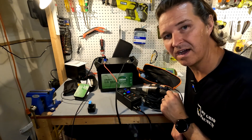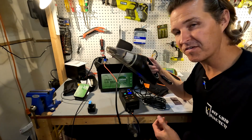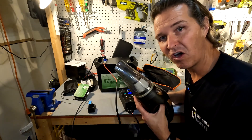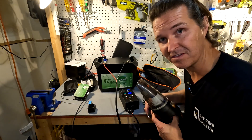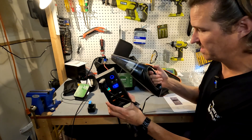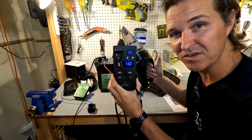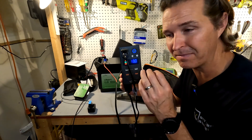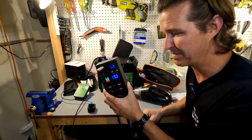To test a portion of the DC controller box, I'm going to plug in this car vacuum — it's called 'This Works.' I use it when camping to vacuum out the inside of my tent, and this thing is an energy hog. Only a couple of portable power stations will actually run it because it requires so much electricity. You can see the voltage drops about half a volt when it turns on, because it runs at 12 volts at 10 amps — almost 120 watts — and this controller didn't care at all.